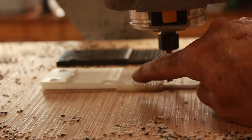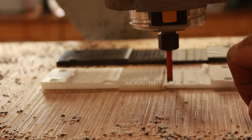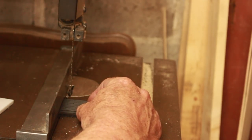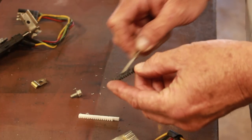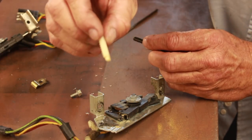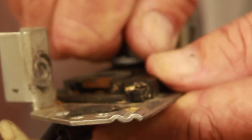There is the original, and when I line that up, that is right on it. So there it is — success! Now let's take a couple slices with the bandsaw and see how it fits. We'll come in here and just file that tear-out off a little bit. So here we have the broken piece from the Lincoln Cruise Control and here is the piece I made out of Delrin. That is working exactly the way it should. This is a complete success.